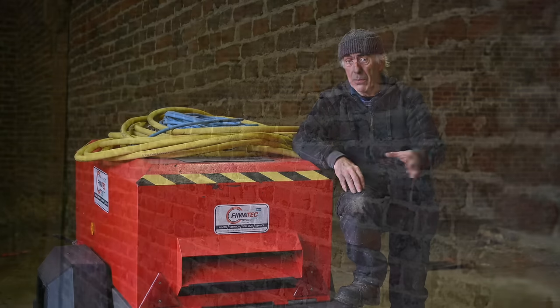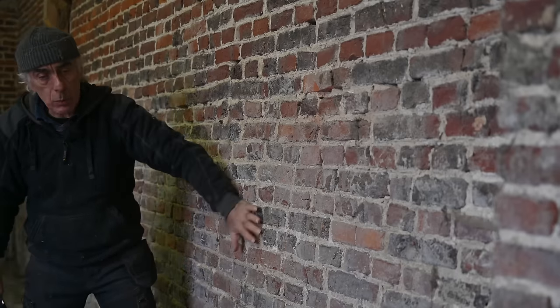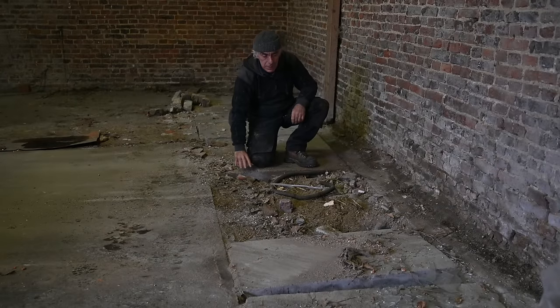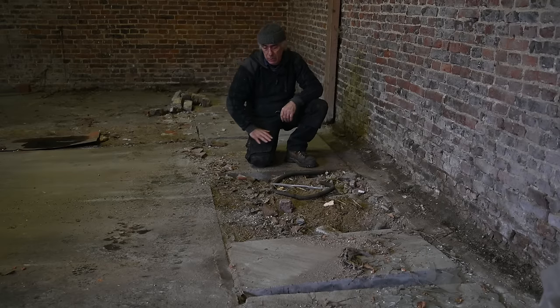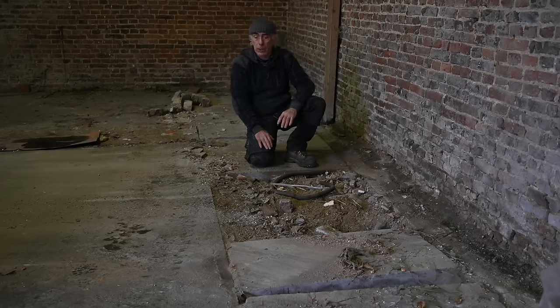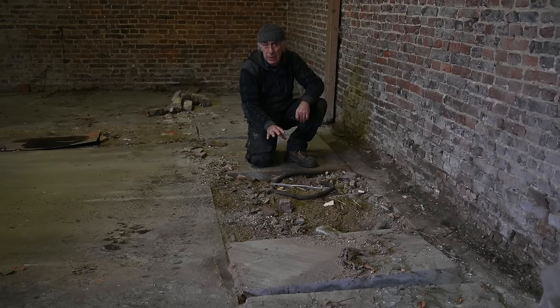One of the things we're going to do with the walls is shot blast them, especially the dirty areas, because this used to be a potato barn and they piled up potatoes loose inside. We'll also deal with these concrete blocks covering an air ducting channel that was used to vent the potatoes — there are areas where it's missing. I need to dig it out, refill it with stabilized sand and concrete on top, before we put down nets, an insulation sheet, and then the final 10 centimeters of concrete floor.